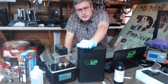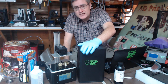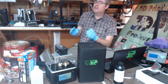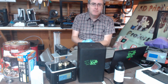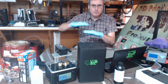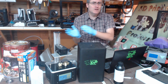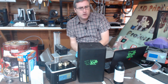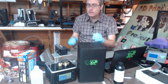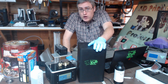Full color touchscreen — yeah, that's pretty cool. But more than that, it can take models sliced in several different pieces of software. And they're not G-code, because this isn't a matter of moving things around — it's a matter of projecting layers and then moving it up with each layer. So not G-code. There are different standards for making things for these printers, and this 3D printer can handle all of those standards, but it can also handle raw STLs.